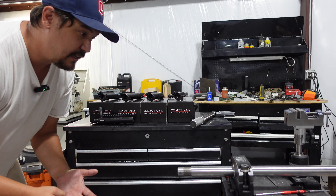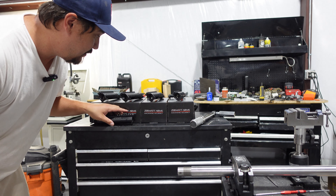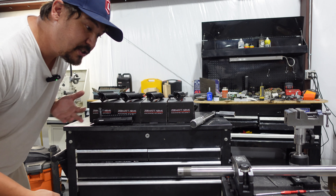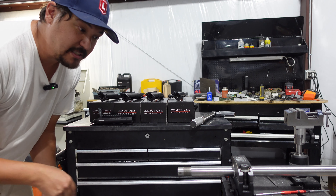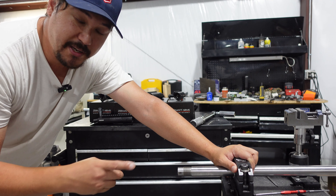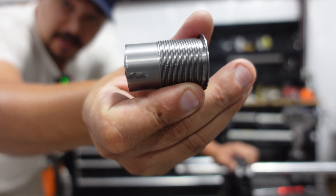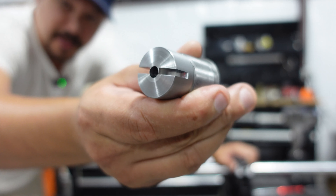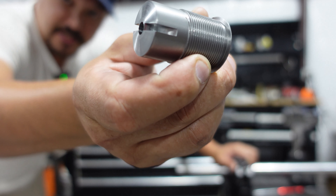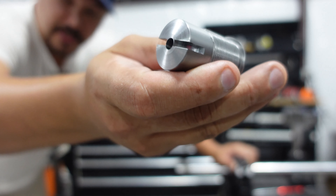Out of my own personal curiosity, I've chosen five random RimX actions out of my shop — all brand new, including a lefty. From my experience building so many of these, I've noticed the threading on these actions is very, very similar to one another. Here's a quick close-up of what the tenon will look like. This is a RimX barrel I've chopped — one of the barrels that did not shoot very well in the past, particularly this one is a Krieger. I ended up putting relief cuts on it so you guys can get a general idea of what it looks like — a little off center line, nice little radius right there. This is what I was talking about with the extractor relief cuts.